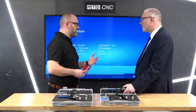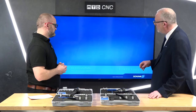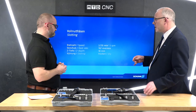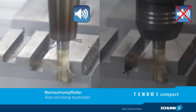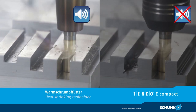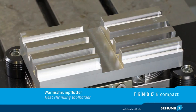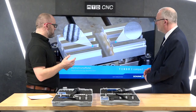The video behind us is showing the benefit of using this system in terms of surface finish compared to other holders. We're showing examples of a hydraulic holder against a shrink fit holder at two different depths of cut. You can see and hear the difference — there is less noise and vibration on the hydraulic holder, and we get a much better surface finish using hydraulic.